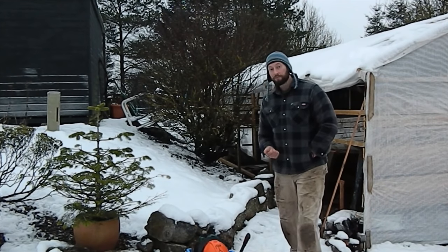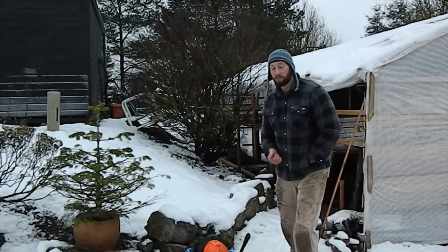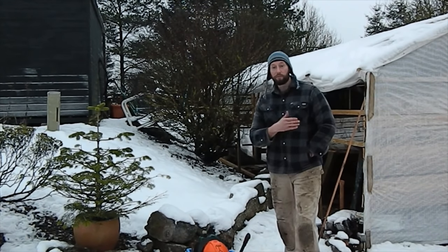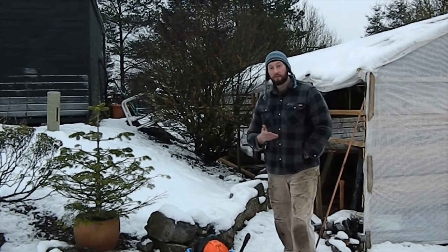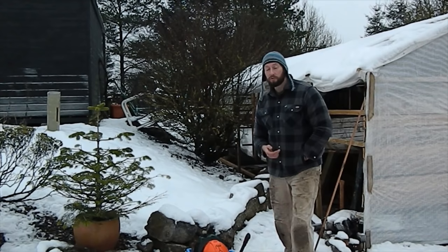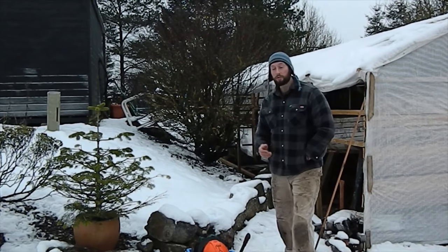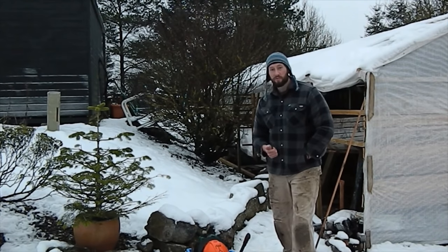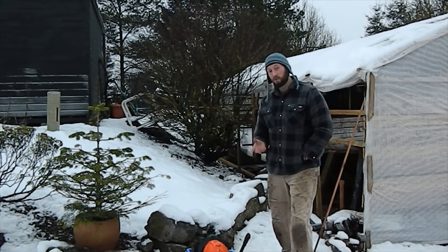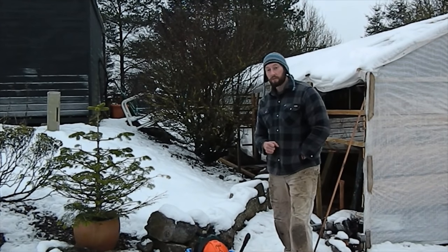Things we'll be looking out for is, one, the species. We want to make sure that we're dealing with a species of oak that we can actually use in boat building. For people who have maybe watched other videos, we'd be dealing primarily with white and red oak. Now, red oak is fairly rare in the UK, but it has been known to be planted on a few estates and plantations, so we have to just make sure that we're definitely dealing with a white oak species. I'm also looking to make sure there's no serious disease, rot, twisting, making sure there's not too many burrs, knots and weird checks or anything sort of untoward in the plant as well.